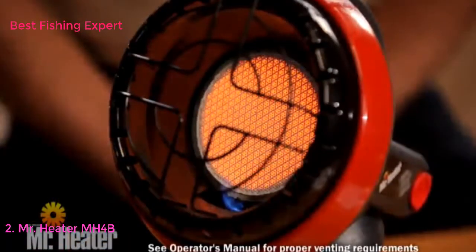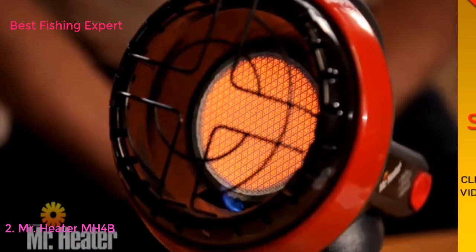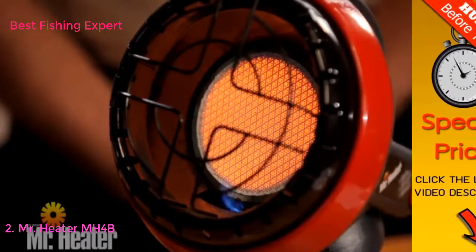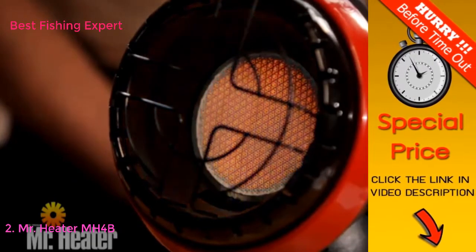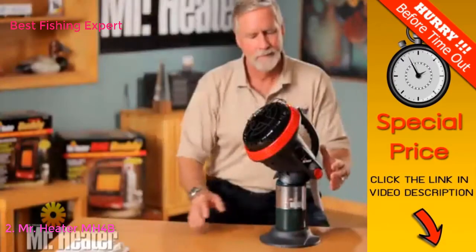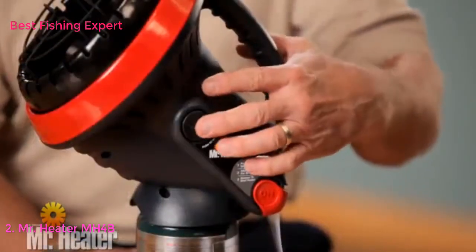All infrared heaters, including the Mr. Heater Little Buddy, consume oxygen in the process of burning and must be properly vented. The Little Buddy is also equipped with a life-saving oxygen depletion system, ODS. The ODS senses the level of oxygen around the heater and shuts the heater down automatically if the oxygen percentage falls below a factory preset level. Now, relight the unit. To shut off the unit, push the off button.